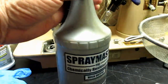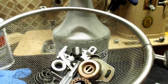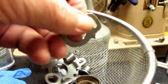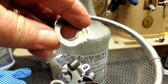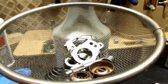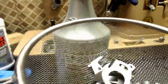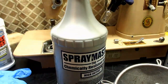I have a spray bottle with my mixture of Crud Cutter at about 25%, so I'll spray them off, examine them in case I have some really thick oil on the back, and I might wipe them with a sponge or a toothbrush. Then I'll rinse with water and blow dry with the blow dryer. Then I'll come back and assemble them piece at a time on the machine so you get an idea of how it goes together.